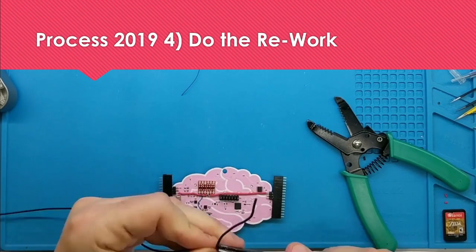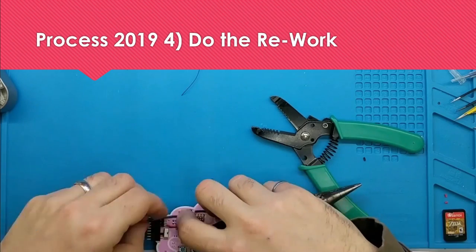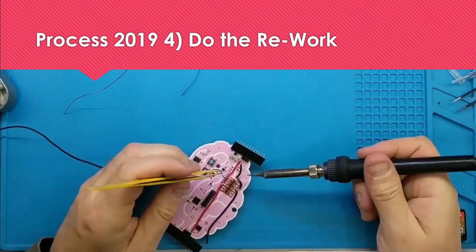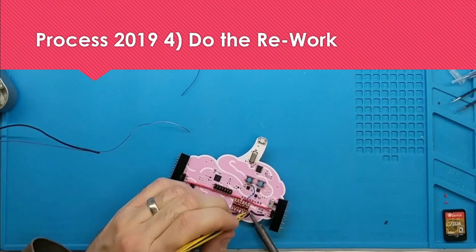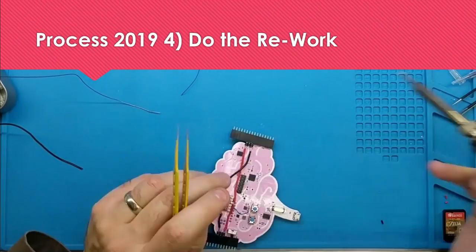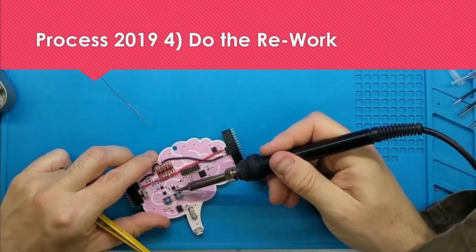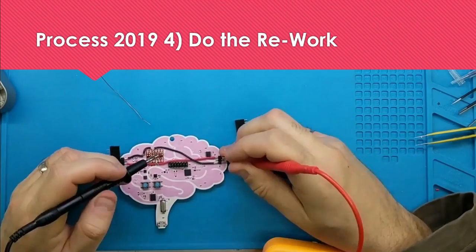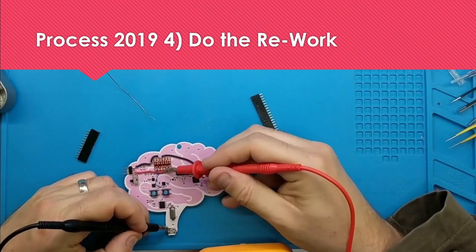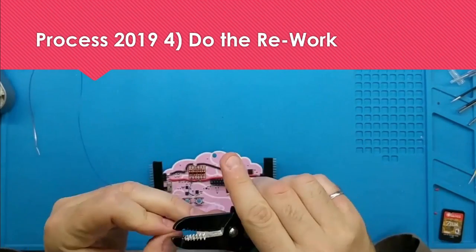Now we shape the ground rail connection — same technique, shape it the right way, take the insulation off in the right places, and solder working from the middle outwards. When connecting to grounds, you're going to need a lot more heat, so be prepared to hold your iron on the ground connection for longer than you're used to. I realized I put the wire on the wrong side of the capacitor and shorted 5V to ground — so I did a bunch of continuity testing to confirm the problem, then fixed it by moving it to the right side. Tacking the wire down again with UV curing glue — I did a little test and it wasn't shorted. Good.